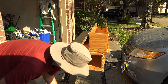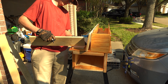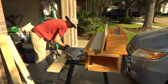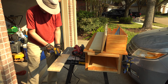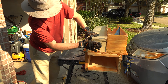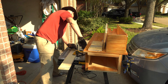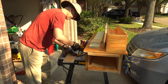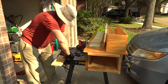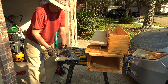Here I am about to get the box all enclosed — cutting the ends, the little end caps to close it off. As I get to the point where I put it all together, I get some clamps because they really helped me hold the box together so I can lay the lid on it and then screw the lid in place. It's kind of comical because I'm trying to get one end fixed and then the other end pops out. I try to use the circular saw but the piece of wood is too small — it's really just a danger — so I end up taking out the hand saw. Better safe than sorry: definitely don't use the circular saw if you're cutting a very small piece. It's good to have a handsaw in these situations.